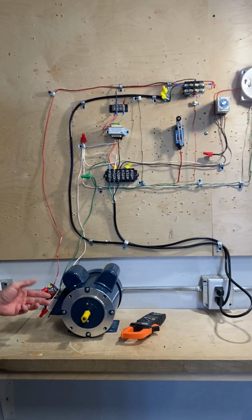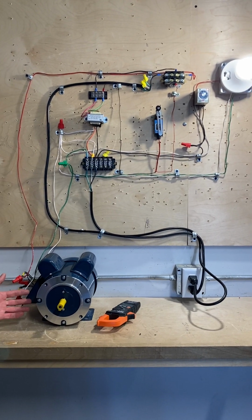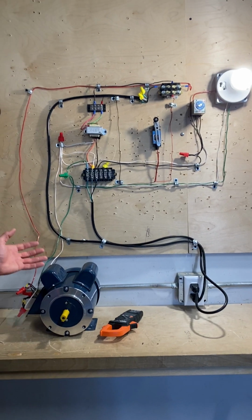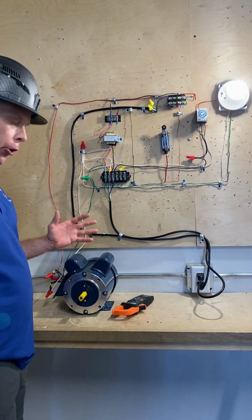And the motor is a single phase 115 volts. I always refer to the diagram on the motor per wiring. Remember, L1 is always your hot, L2 is your neutral, and always ground your motor.